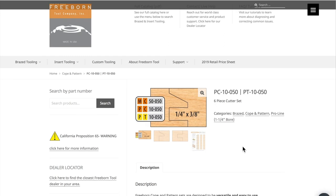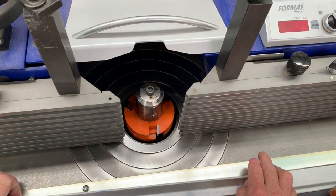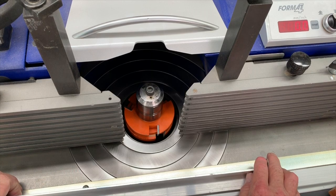I'm using it with a top hat bushing top and bottom and three cutters installed on the spindle, since my spindle is 30 millimeters in diameter. That's the cutter set. For this stile and rail frame and panel style door operation, I'll show you how I go about setting up the shaper to machine the profile for the stiles and rails on the inside edge.